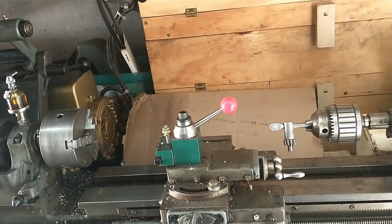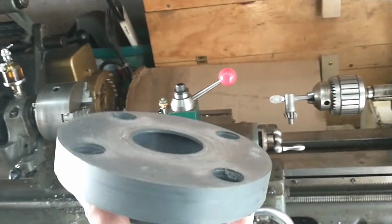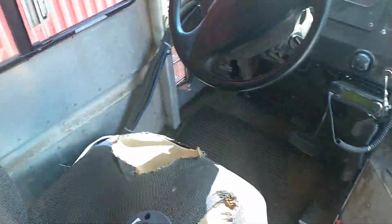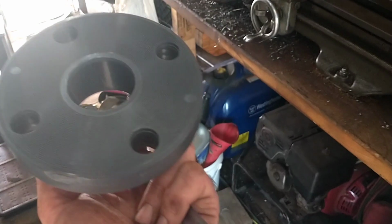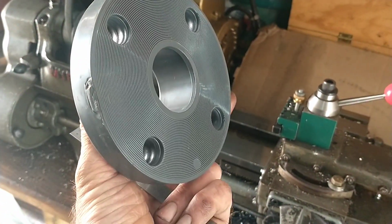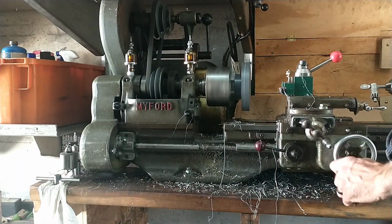So when I've got a hole like that where just the outside edges are blown, this is a really fast, and I'm not going to say you're splitting tenths, but pretty doggone accurate way of getting these things cut to, or lined up on the center line anyhow. So I'm going to get this stuffed in a lathe and machine some lineup spacers here. All right, we're going to see if we can shoot a little video of this process.